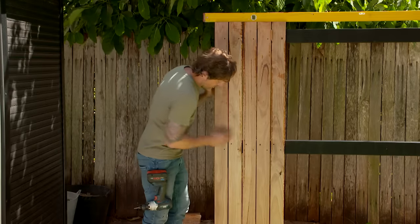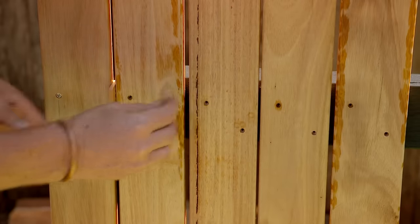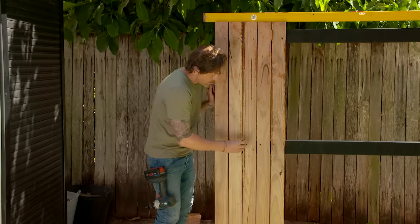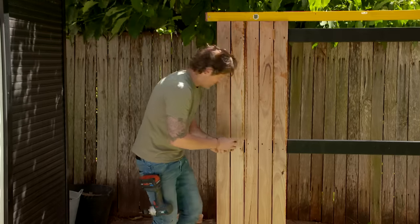You can see what I mean with this centre rail — our first gap is absolutely fine, the second one far too big, the one after that too small. So I'm going to get a chisel into this one, pull it all over this way, and make the gaps nice and even.